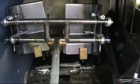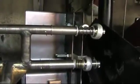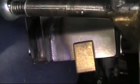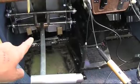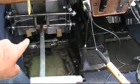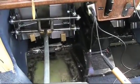The difference between this design and the previous design is that we have introduced bigger stiffness on the sides of the pedals to counter the bending of the pedal attachment itself. We still get a significant stress concentration between the stiffener and the latch, so that's basically where the weak point of the design is. But I'm optimistic it's going to work. Those things holding the pedal onto the rudder at the bottom are just there for today's test — those are not the actual G-clamps we're going to be using.